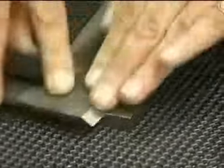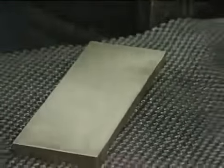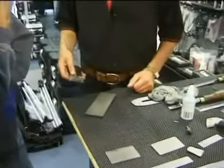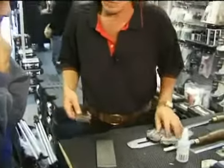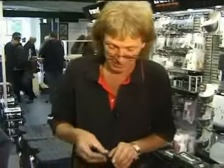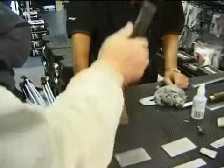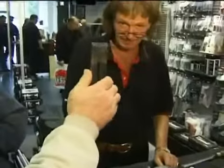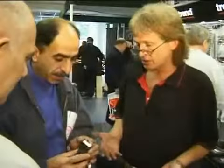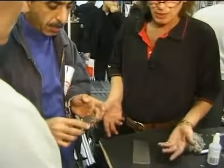that way around. Now it's just a useful method to try, because let's face it, using a honing guide is a little bit laborious, setting it all up and getting there, and to be able to just quickly do that by hand, I've got a lot of people who now actually use that method quite successfully, and hopefully we might have a bit of an edge on there. But if you want to go on then to something like a 12,000 grit Japanese stone, do.